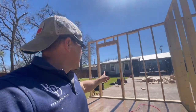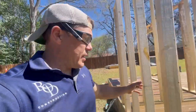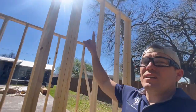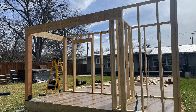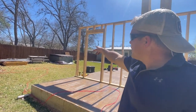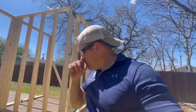Wrapping up for the day. 2x6 wall done. Got these two inside walls for the storage room all framed up, everything attached. Haven't anchored anything down yet — still braced up. I'll put one anchor in to keep it down for the evening. You can see up there why I left that down — it's for my 2x10 beam that's gonna run across to that column. Same thing, left the bottom plate open and two studs down to catch that beam going across. Good progress for the day — happy. Get back at it tomorrow, get the rest of the walls framed up.